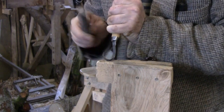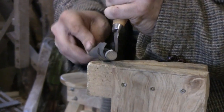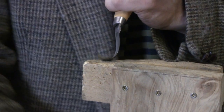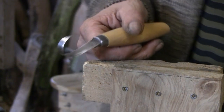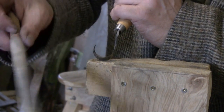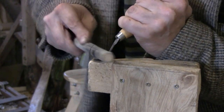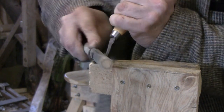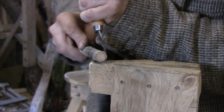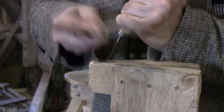After you've used the slips, you can go on to using strops. You may find that if you do go down to 2000 grit silicon carbide, it's not absolutely necessary to use a strop, but it often helps just to polish the edge. And again, this is just a piece of leather wrapped round a dowel, and it's got a polishing compound on. I use the gold FlexiCut stuff myself, but there are all sorts on the market, and you can always use a metal polish like Autosol.